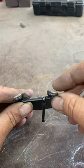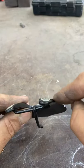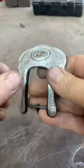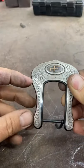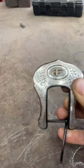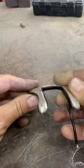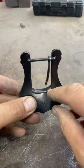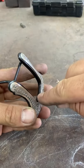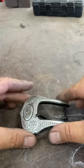I'll show you that in a second, but I just grind this down — I'll do it on the sander, actually. I round this away. You can see I've got a little round going on here. Blend it this way, blend it around. I've got these little design accents going on there. Those are just little things to add a little interest. They don't change the shape of the buckle, but they add a little something to it. I scribe a line on the inside here, scribe it and then file it. I do all of this shaping when everything is flat, when my buckle is flat.